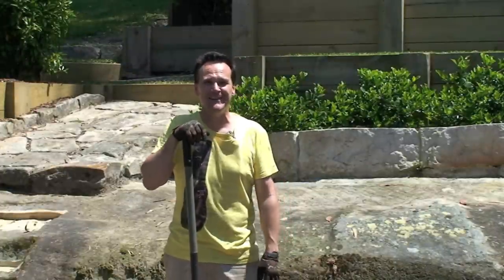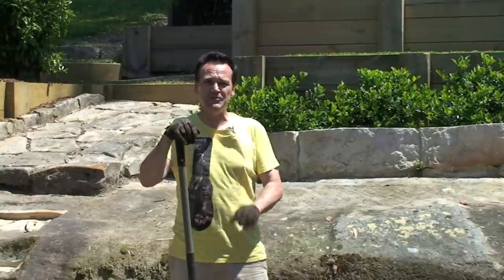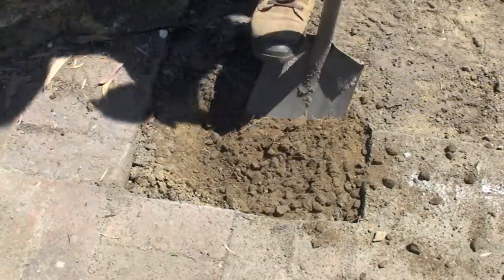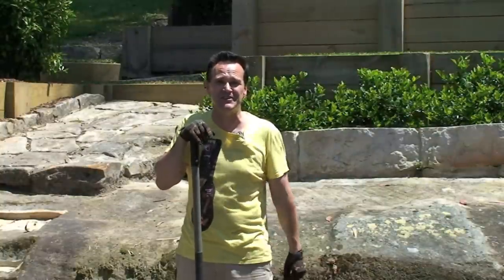Now I can get round to building my garden bed. Because I'm using the same principles as a retaining wall, I only need a post in each corner and one in the front. The post holes will just be big enough to take a generous amount of concrete to secure everything in place, because it's not a major retaining wall after all, it is just a garden bed.